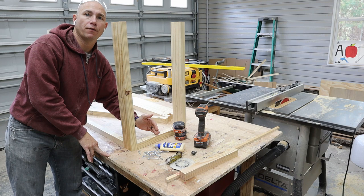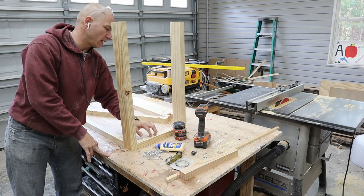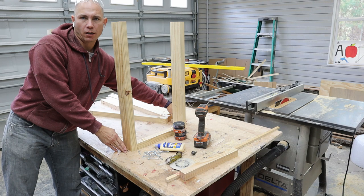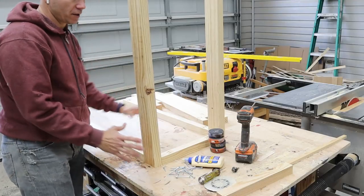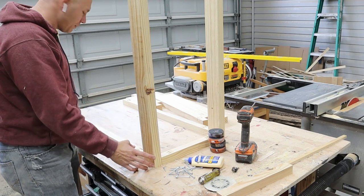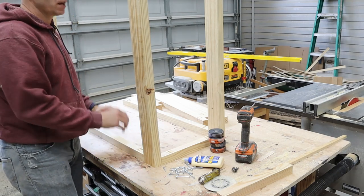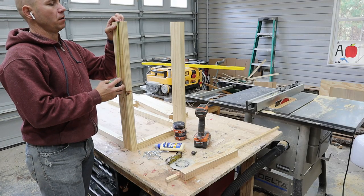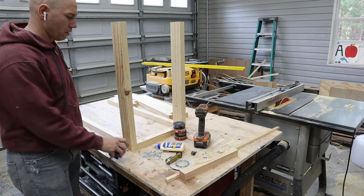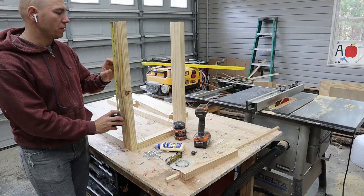The basic way the frame goes is just like this. These side pieces I cut at 14 inches — my top is just a little bit over 20 inches deep, so I cut these 14. Set all this up, get everything clamped, put the screws in. For the bottom shelf, I'll take a tape measure — I'm thinking I'm going to put that shelf in there at about eight inches.